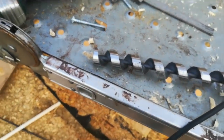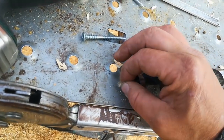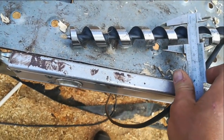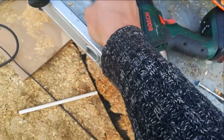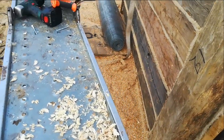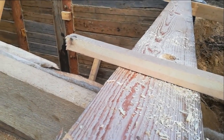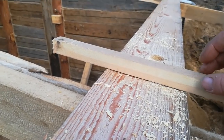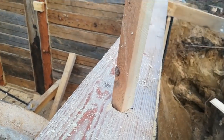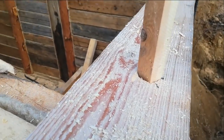This is an ideal point to just make a couple of points. Firstly, here's what happens if you try and drill through that insulation. It gets all bound up on there and the drill won't go any deeper. But about this drill bit, it's a 28mm. And the reason I use a 28mm is because, around here at least, your standard building plank is 22mm thick. And what I've found is if you run that 22mm plank through the table saw at 22mm wide, so it's 22 by 22, then it goes very, very snugly tight into the 28mm hole. It's a perfect fit. Let me drive that in.